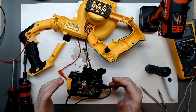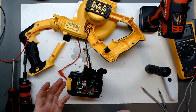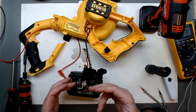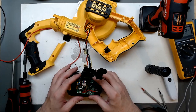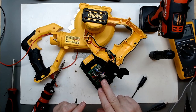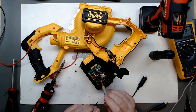We don't have variable speed, but that actually is a way to run it if this was just dead in the water. I would disconnect some of the stuff so nothing back-feeds through the diode. After testing the motor, speed control contacts, and confirming it's just the board not putting out, let's bring the meter over on volts DC.